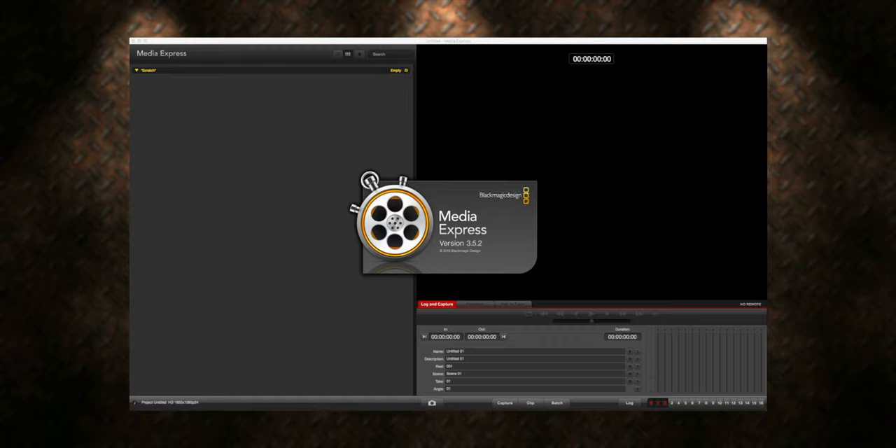Let's say you're working sports and you've got a two-hour game, and you need to just go through that footage really quick and capture a two- to three-minute clip reel and feed it out to whoever you need to send it to. The quick and easy way actually isn't to try and copy all that media, because that's going to take a while. What you can do instead is just use this box with the Blackmagic capture utility — included for free — and use the HyperDeck Shuttle basically as a high-speed tape machine. Just cruise through that footage, capture the 10- and 20-second clips you need, do it all on the fly, slam it together, and send it out. It's a really fast, kind of old-school meets new-school way of working.